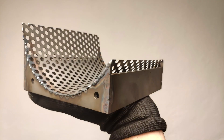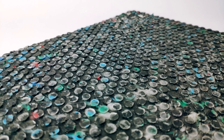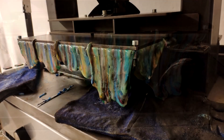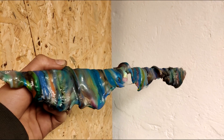One day I saw a perforated metal sheet I had used earlier for building the shredder sieve and got the idea to make a nice pattern on a board. That was a bad idea. The sheet metal was heavily bent during the molding process, but I still use it as a big sieve and the plastic board is fine. You can create a plastic waterfall effect if you put too much plastic into the mold. From a visual perspective it's a cool effect that can get a lot of likes on social media, but from a plastic recycling aspect this indicates a lack of experience.